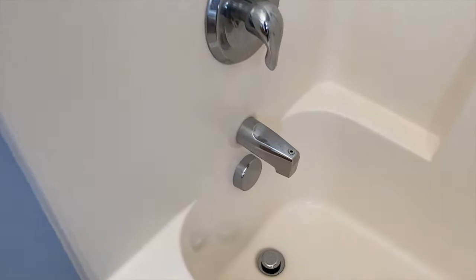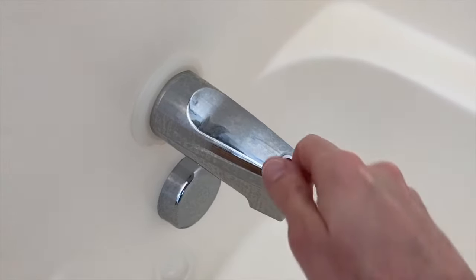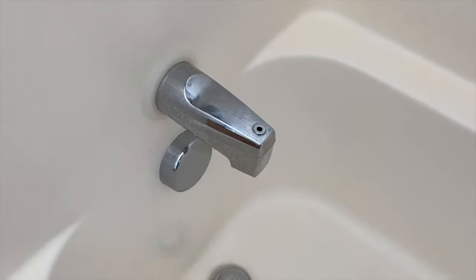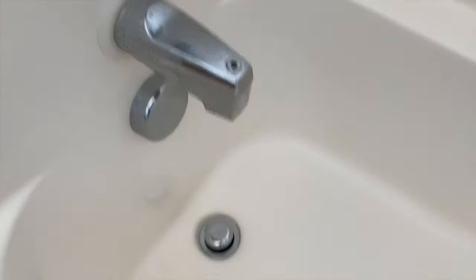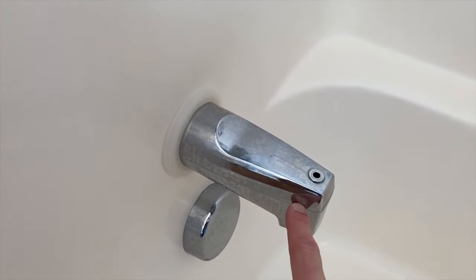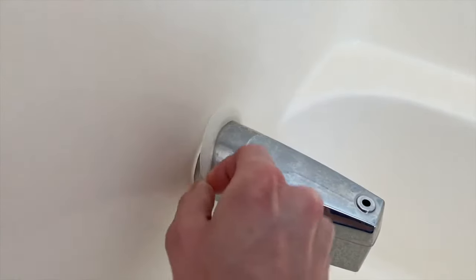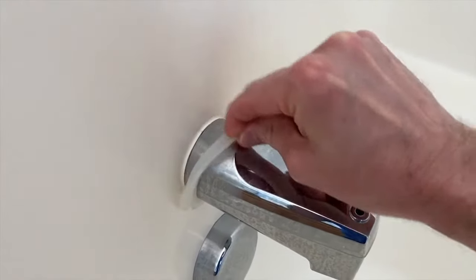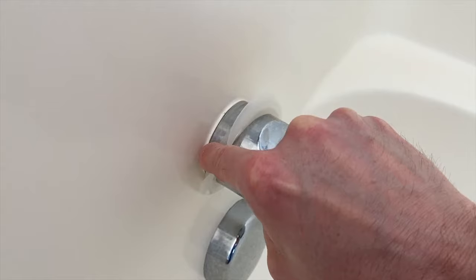In the bathroom now, and there is the tub spout. As you can see, the diverter lever, handle, or knob is missing. All we did was pull it up to divert the water to the upper shower head and it fell out and into the tub. What we need to do is remove this tub faucet or spout. In our case we've got this little rubber seal — yours may be caulked or siliconed around the actual meeting point of your spout and the shower wall.